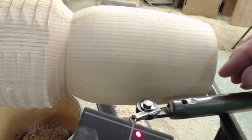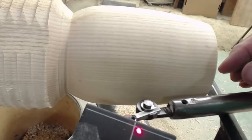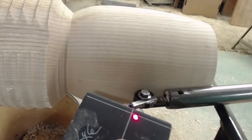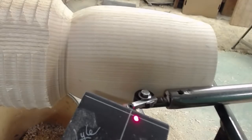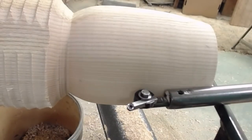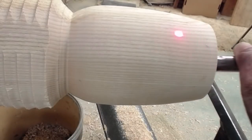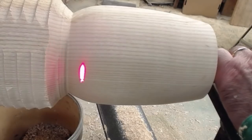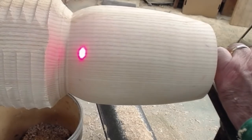So now there's my angle — you can see where the laser is, it's not quite in the right place. I'm going to move that over on the line so I can tuck in around that corner and make sure the laser is perpendicular to the wall there. The gap is what's doing the measurement, so as I'm working down in that area, I've got to make sure I'm measuring accurately.